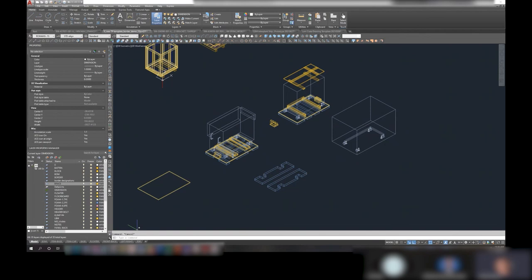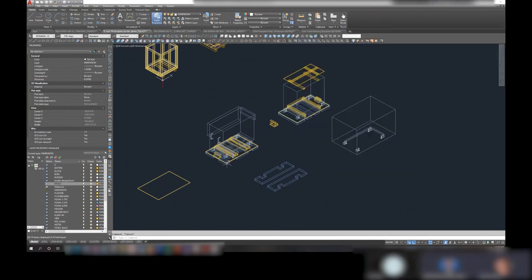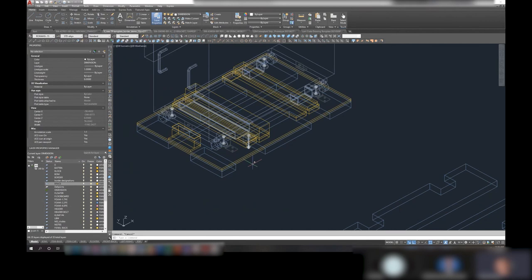So remember, the only thing I can tell you is you can divide into up to 10 pieces. If you want to put so many locations, can, no problem. But the total foam area that you use cannot be smaller than your calculation. Just now we calculated 2,000. So all these pieces, you add up all the square inches, you cannot be smaller than 2,000. You can go a bit more. 2,002, I also don't mind. Okay?